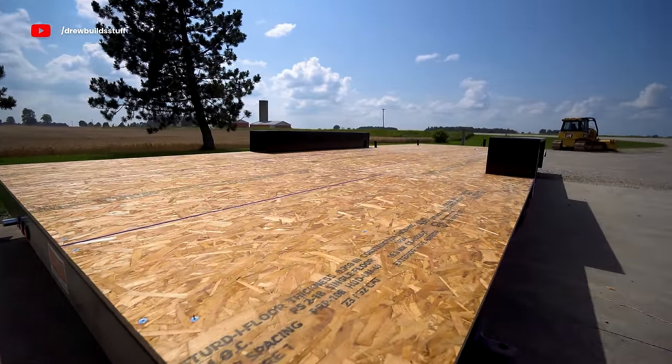This vertical to horizontal transition has a certain way everything needs to be cut to shed the water properly, and it's actually the exact same way you trim the windows, which I'm going to cover in a couple minutes, so you can apply that information here. I also could spend probably 45 minutes on covering the siding alone. I'm kind of condensing this, so this isn't a 6-hour long video, but I'll put a couple links in the description below of videos I use to learn how to side, because of course this is my first time siding.